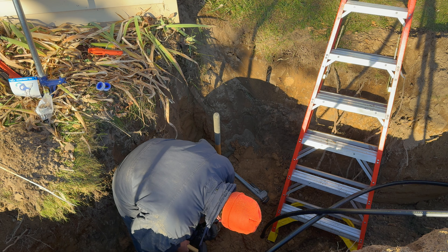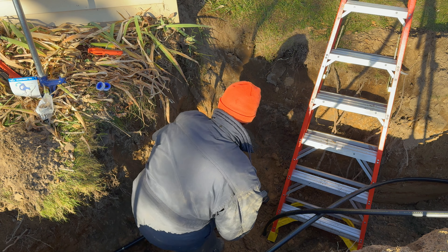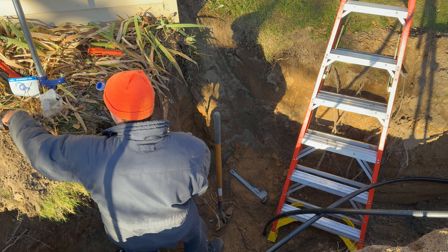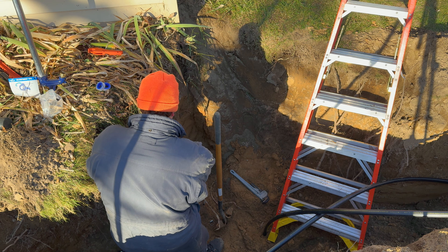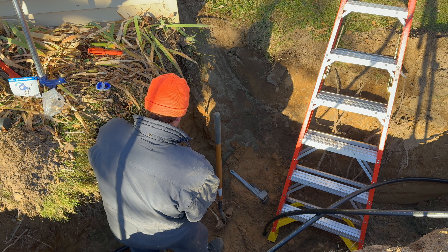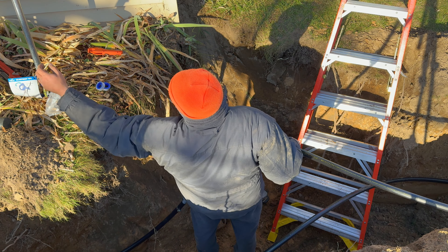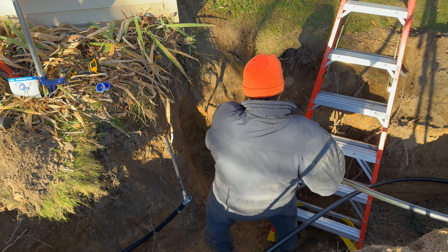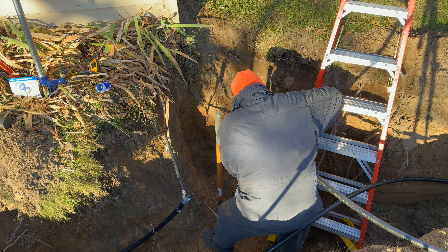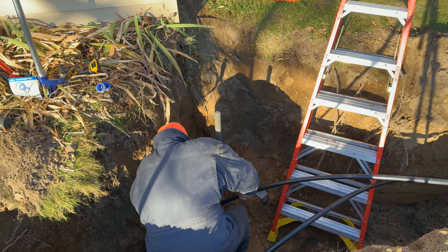Installing just a short section of pipe here rather than running the pipe into the corner - I'm putting a T right there and teeing off to go to the corner. It was like a two or three foot section of pipe. The fitting in this case I got for a dollar, but it's a three-quarter fitting. So I bought a one-by-one-by-three-quarter T and I'm using a little piece of three-quarter inch pipe so I can use that cheap dollar fitting. Otherwise the fittings for these are a little pricey - like 10 or 15 bucks a piece for the good ones. The ones I got were really cheap at about a dollar each. I'm running all one-inch pipe, but I couldn't get all one-inch fittings, so I had the one three-quarter, which works out perfectly for right here.